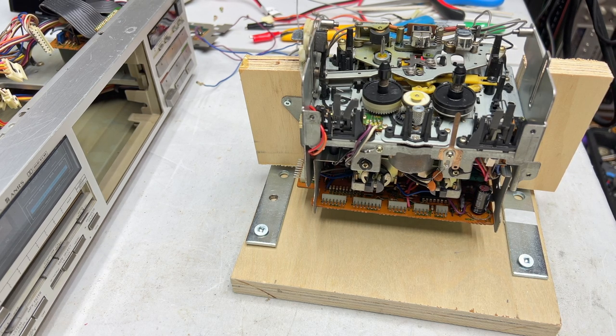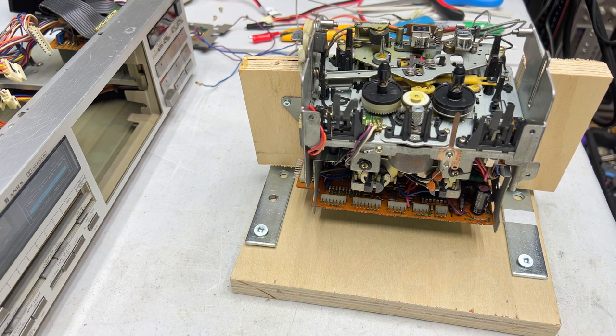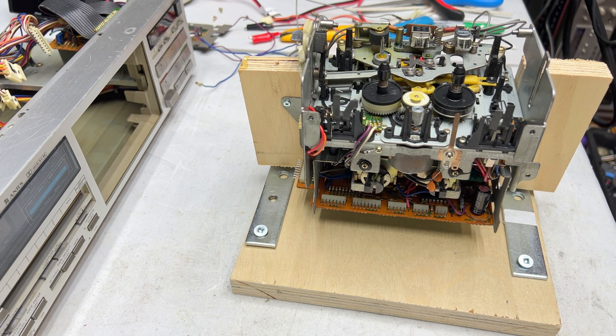Yeah, on the TDV 931, I'm getting something like 20 grams per centimeter on the take-up side, which is way too low. And on the back tension side of it, the reading was actually off the scale. My torque tester tape can't go as high as that measures. I would estimate it's probably somewhere around 12 to 15 grams per centimeter, which is also way too high.